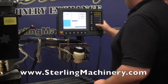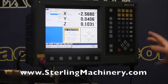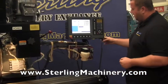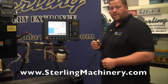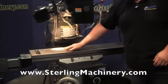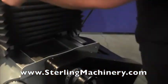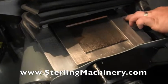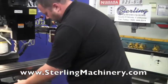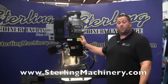You can take a look at our website for this controller and you'll see there are a lot of different options. It's a pretty capable controller, but very easy to use — it's got teach setups, a floppy disk, and a joystick to advance to the next step. Take a look at the table — everything is nicely scraped, which is great for oil distribution. The bed has chromed and scraped ways. From top to bottom, this machine is about as new as you can get for a used machine. Somebody took very good care of it — I think it actually came out of a prototyping lab.